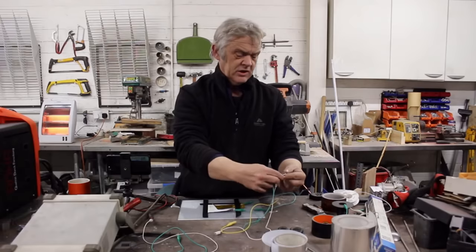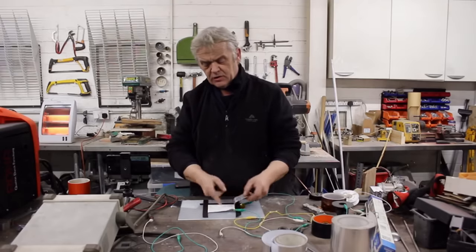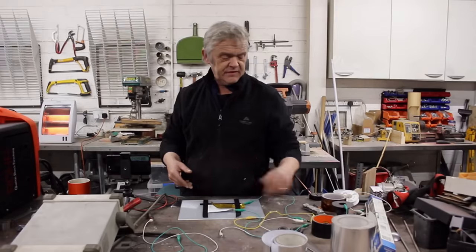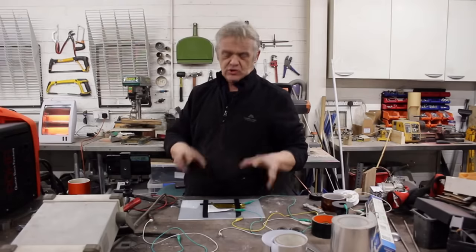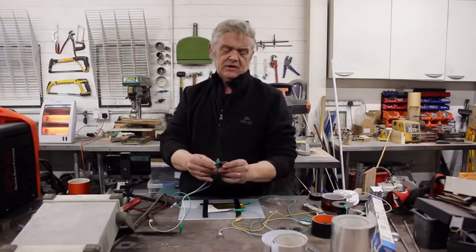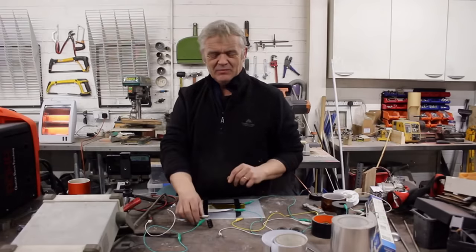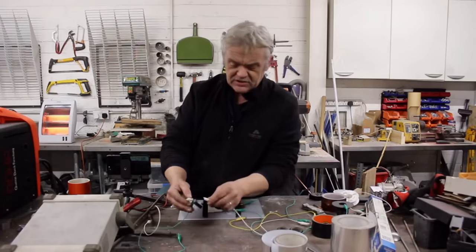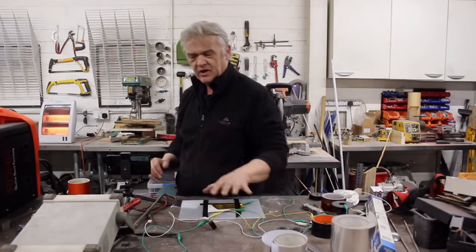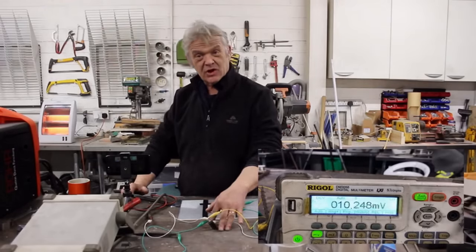The input is my two aluminium sheets — one covered with Kapton and one covered with Teflon, with the Teflon facing up touching the aluminium. The Kapton is just there to stop me touching the aluminium and interfering. Now that we've rectified the current, we want to collect it in a capacitor — I've got a 1000 microfarad 50-volt capacitor, because the research says this will generate about 30 volts. I connect the negative to negative and positive to positive, then connect it to my multimeter, and we start pumping electricity into the capacitor.